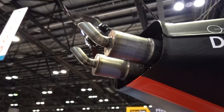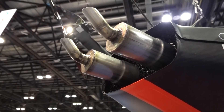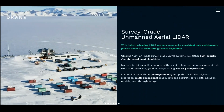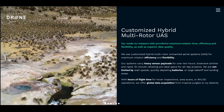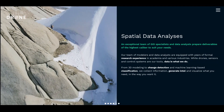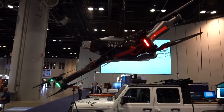As an aircraft, I can see what looks like exhaust — is it burning fuel? Yes, absolutely. This is a Pegasus GE70 unit that gives us about four kilowatts from a little 70cc water-cooled two-stroke, and that allows us to keep this thing airborne for about two hours in one go. Then you just refuel it — five minutes and you go back up. In the environments we work in, you usually don't have the option to charge batteries, so you just get your vehicle, get some spare fuel cans, and you can do jobs for hours every day without having to recharge.